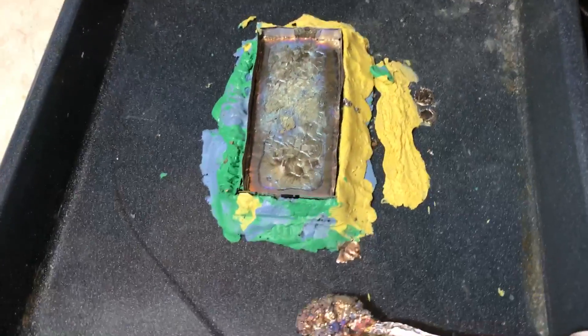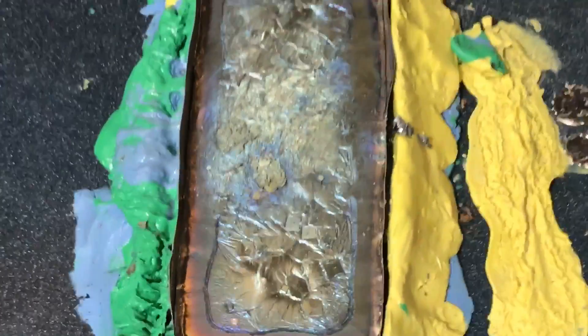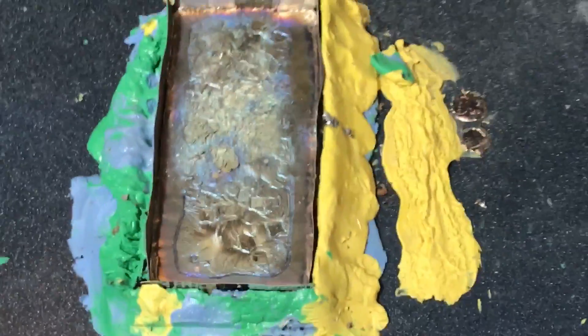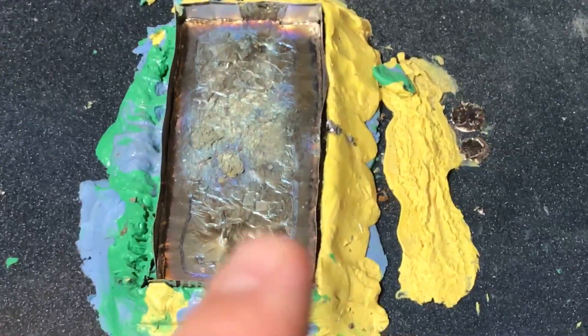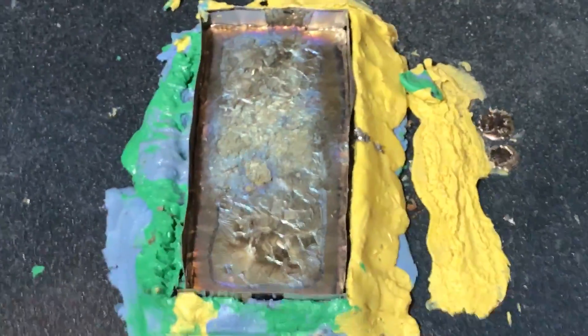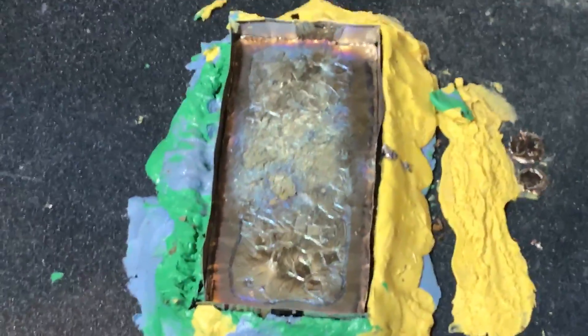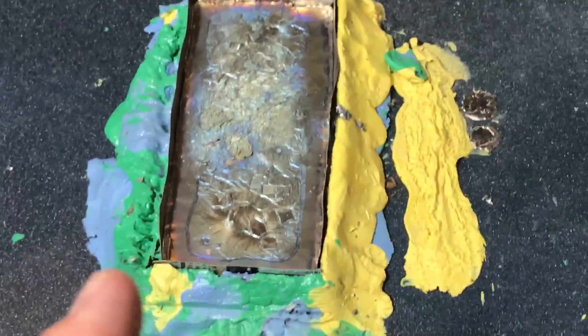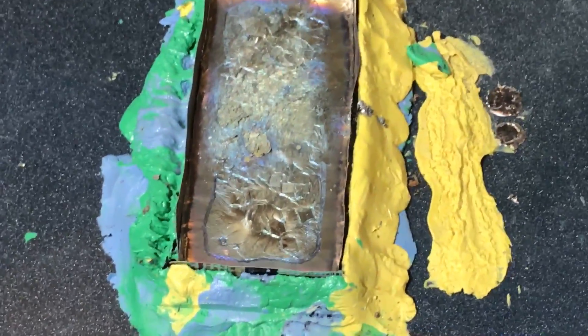This is still about a couple hundred degrees. Take a look at the fork here — I was actually spooning the slag off the bismuth as I was melting it. These little cubes here are bismuth crystals. This is a cooking tray, and around here is just modeling clay. What I used for a mold was a cut-up soda can — I cut it out and bent the corners to make a perfect rectangle like that.